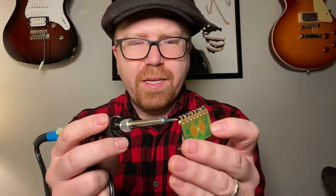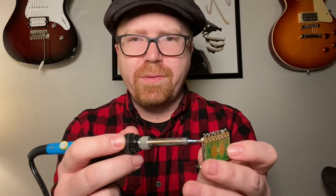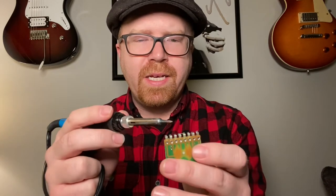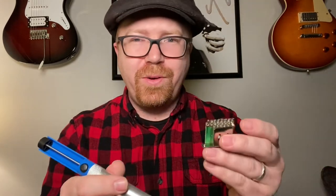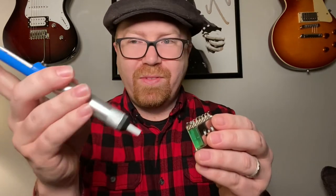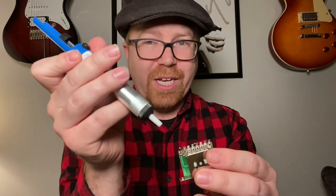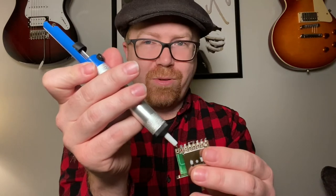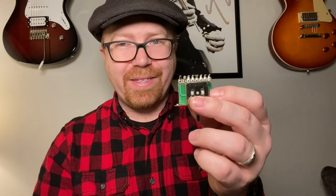Here's what you need to do. Your ground wire, you can just put anywhere on the side there — that worked for me. This little solder sucker will take care of excess solder. Especially when you're removing the old stuff, all you do is press it down, put it near the solder as soon as you've melted it off, push the button, and it sucks it right up. That gets it out of the way.